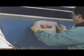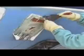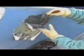The applied thickness of the peel-away marine safety strip is determined by applying several test patches of varying thickness at several points around the hull. The efficiency of the chemical removers will vary with ambient temperature. If the temperature is colder on the day of stripping, the chemical must be left on longer than the test patch results to compensate for the temperature change. Ultimately, the test patches determine the optimum thickness and application time for the removal project.